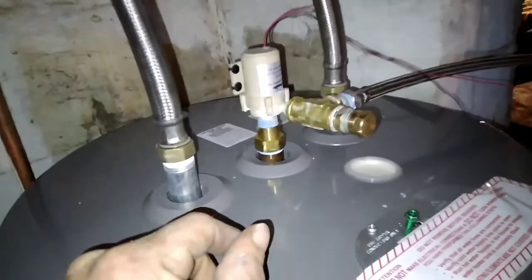So I've got the fittings to set the pump on the bottom pulling, so it'll never run dry. There'll never be air trapped down there. And then it'll just push the water out the other way. Or right here, it's sucking it out of the tank and pushing it into the line. There, it might work more efficiently pulling it down and pushing it into the tank. And then any bubbles that are trapped in here will just get sucked through the line and purged into the tank and then relieved through here when I open another faucet and let it just run out.